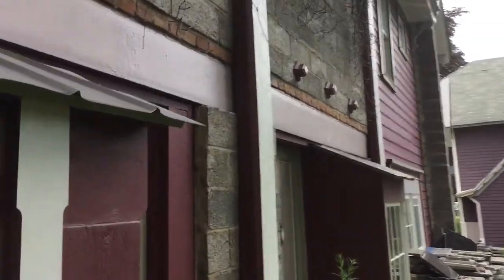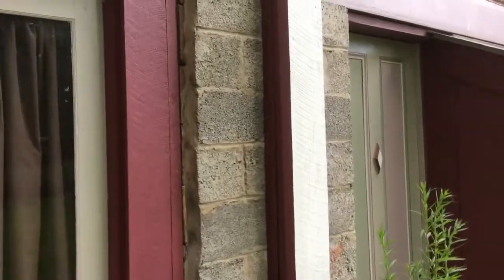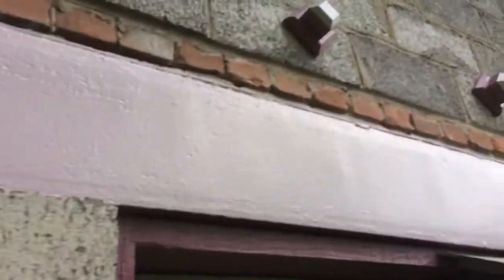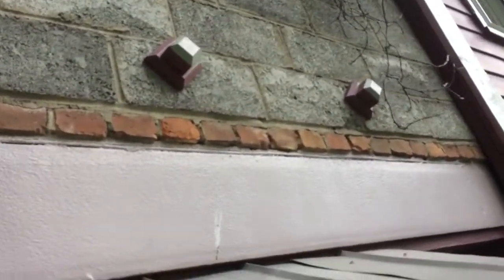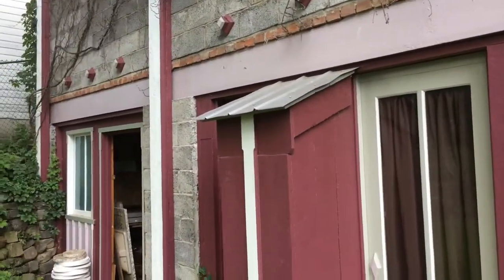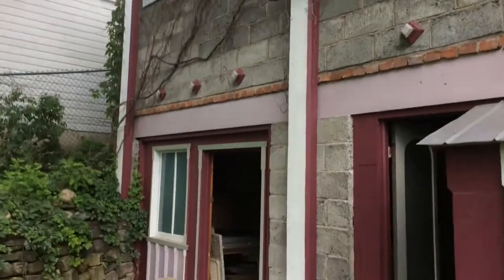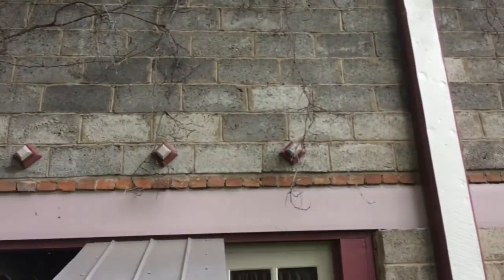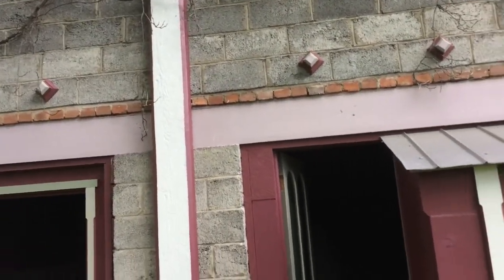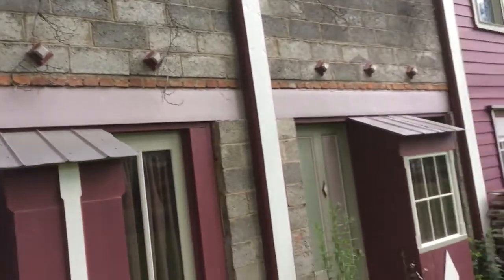And what we did was we put threaded rod through, 40 of them about, and we gradually tightened them down. So the threaded rod are inside of here, all the way up through. They're inside of these. So you can see we have them all the way down in 4 pillars, because we even did the edges. We didn't want that to fall out. And then over a month to 2 months, we gave them a turn or 2 turns or 3 turns a day. It went in really good.